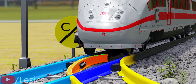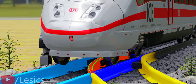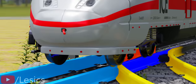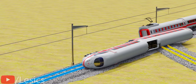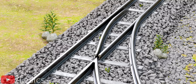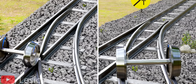The issue is the crossing. The tongue tracks cross at a point. If the crossing design is like this, the train is going to hit the orange tongue and derail. To overcome this issue, just provide a gap near this crossing in both the rails. In this new crossing design, whether the train is going through the left or right track, the wheels cross the junction without hitting any track.